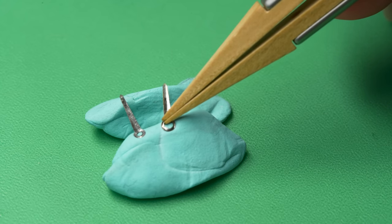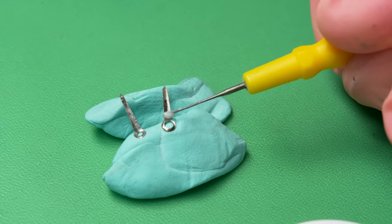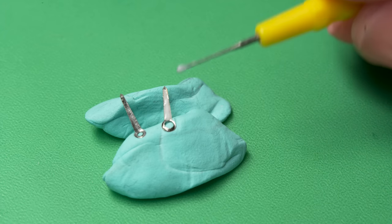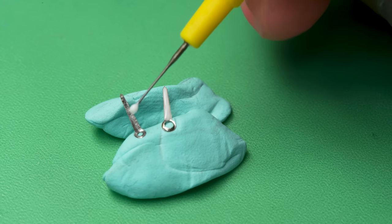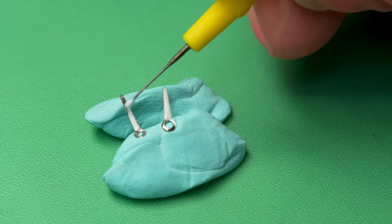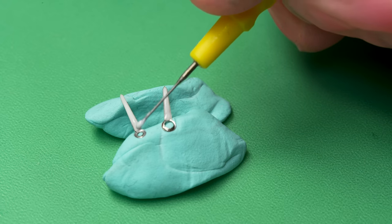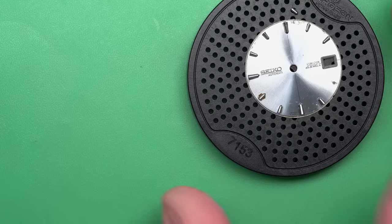Here are the hands — I know from the other watch I did that these hands actually come from the factory with luminous compound on the bottom. It looks like somebody has scraped it off, but I'm going to replace it. Think about how companies design things like a watch — they're well thought out. If you made a watch that had glow-in-the-dark indexes for each hour and you didn't put any glow-in-the-dark material anywhere on the hands, it would defeat the purpose. The fact that these have absolutely no luminous material on them is a very strong indicator that something's wrong — they're supposed to have it, and there's nowhere to put it on the top side, so it actually has to go on the bottom.